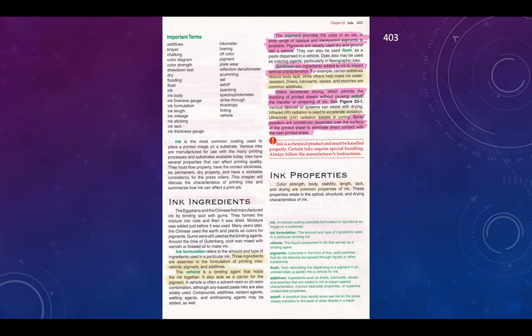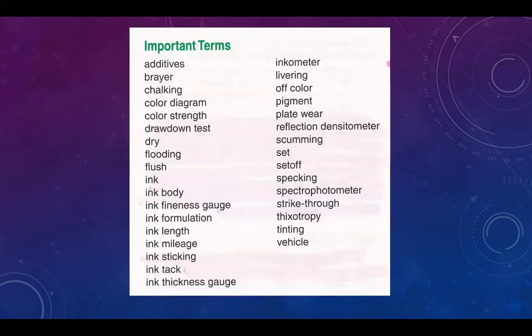They're made with different things. They can flow differently. They have different stiffnesses, different stickinesses. They dry differently. They work on different types of substrates. They will work on different types of presses. Typically speaking, unless you're talking screen printing, in which case all bets are off because that stuff can do anything, you really need to very carefully match the ink type, not only to the substrate, but also to the press type. Some inks work well on some systems, but would do nothing on another. We'll get to that.